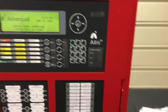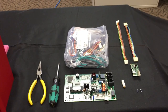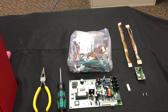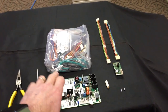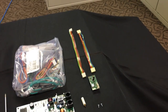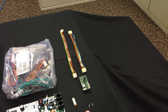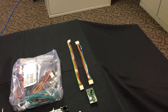We have our fire panel here and on the table next to it we have a few items we're going to need. We've got a small pair of pliers, a Phillips head screwdriver, the digital communicator and the bag of wires that go with it. For the SEB card we've got the standoff, the screws to put it in place, and the two ribbon cables that marry that unit to the panel.